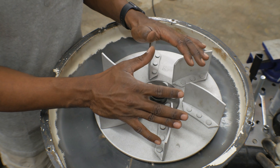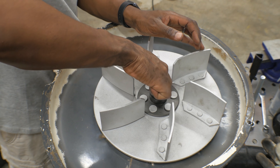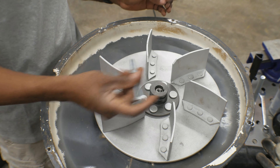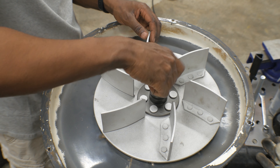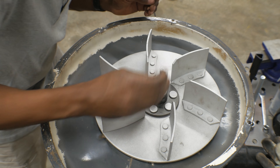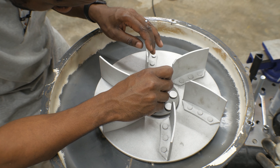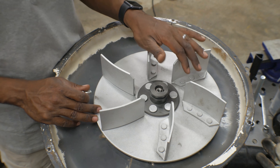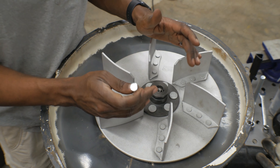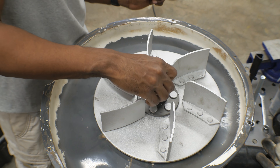So far, all the fasteners on this assembly have been metric. I went and grabbed an 8mm bolt, and it just will not thread in there, at least not easily. Then I grabbed a 5/16ths coarse thread, and it won't thread in there without feeling like I'm having to force it. So I went and grabbed the thread gauge — I've got it set to 1.25, which is what it should be for the 8mm fastener, and looking down in there it sure looks like 1.25. Finally, I downloaded the manual, and it definitely says M8 by 25mm fastener, so I'm now pretty confident this should be an 8mm thread, and perhaps just the first couple threads are rough.